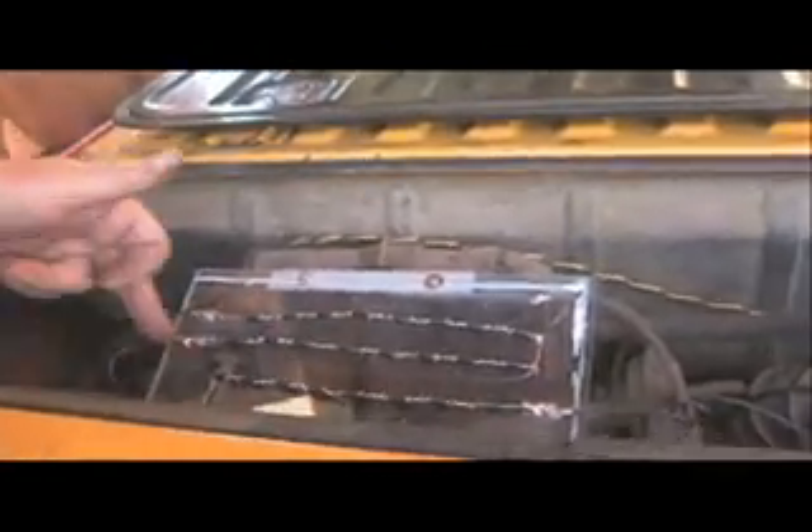It goes right down to the top of the plug and it's in parallel with the high voltage wire. This is the input from off the top of here. This is wired backwards and it shouldn't work, but we are getting plasma. The interesting thing is the inverter registers zero amps current flow, and we know that the battery isn't connected during the spark — so the question is: where's the energy coming from?